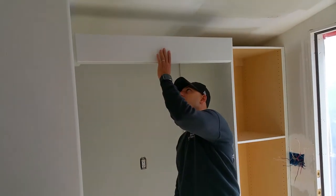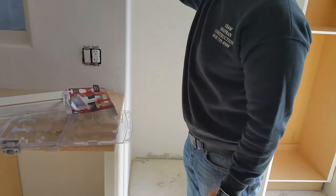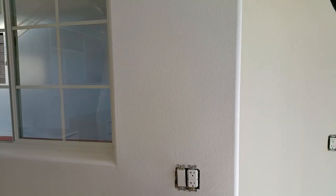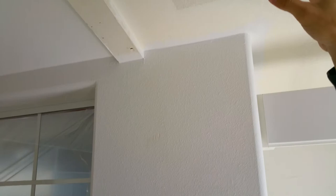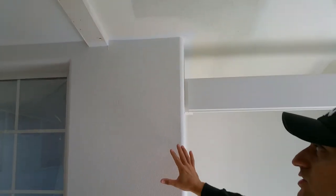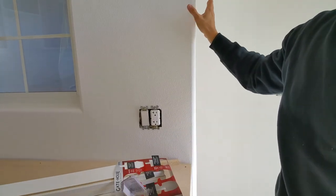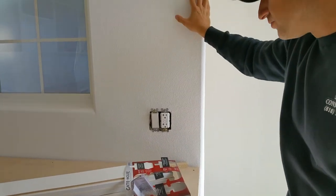So we are good to go. Once we installed the drywall, I want you to take a look at the ceiling — you can see we sprayed with the texture. Once you spray the texture, you want to prime the walls. So this is basically primer without any paint. It kind of looks like there's paint on it, but these are only two coats of primer.